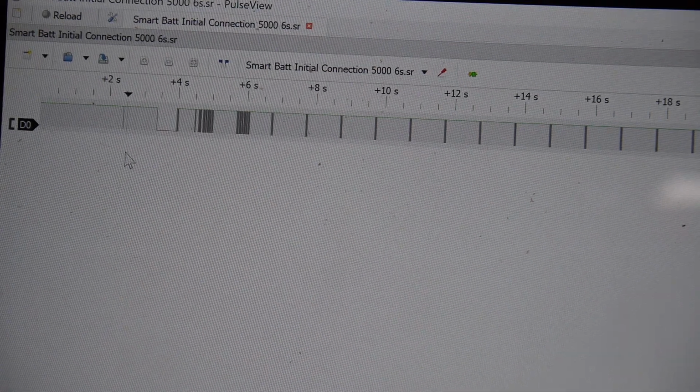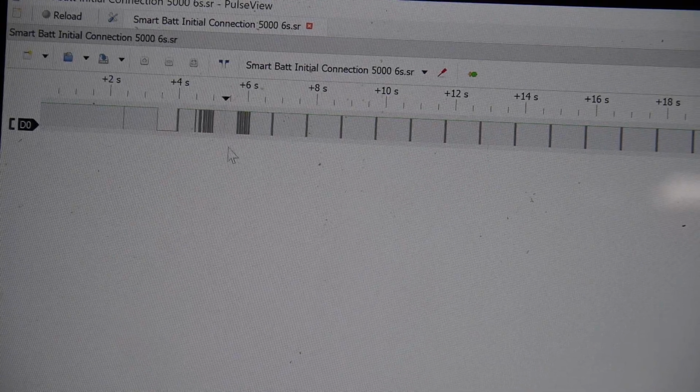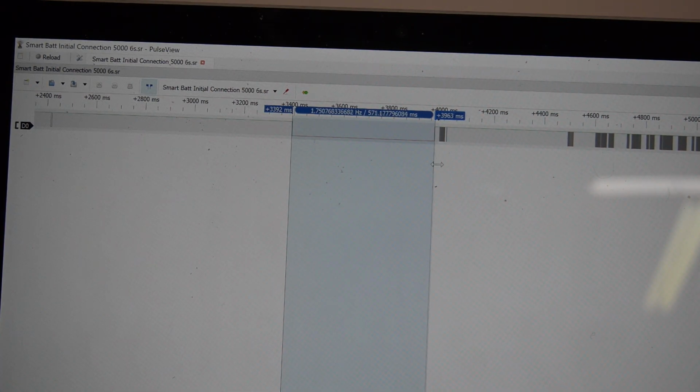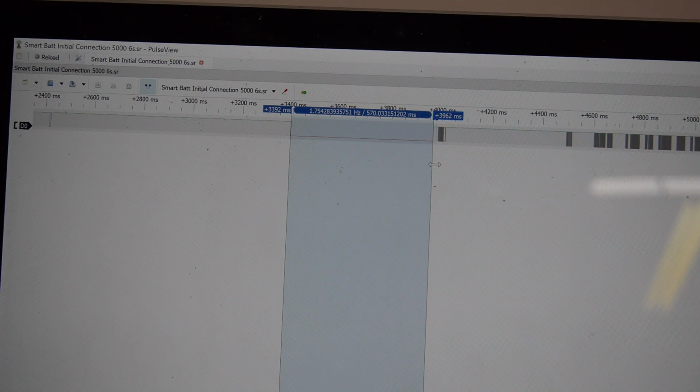And then, an unending series of equally spaced data pulses. The first burst of data is likely to be all the battery stats that get loaded into the device at first. One weird thing is a long section where the data line is pulled down to 0 volts. But I didn't recall seeing it again on any other test samples.